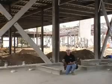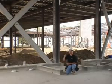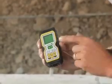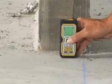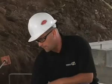One of the applications the LD-400 was designed for is commercial job sites like this. Contractors have to measure steel studs that are going to go up to the roof deck to length — in this case about 18 feet, so it's hard to do with a tape measure. I turn the laser on, and one great feature is that on a dimly lit job site like this, I just push the light button and it has a great backlight so it's easier to read. I take the laser, set it down where I want to measure from, use the laser beam, point to where I want to hit, hit the button — 19 foot even.